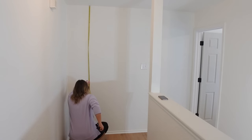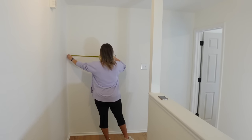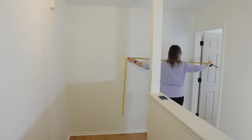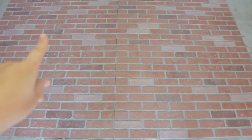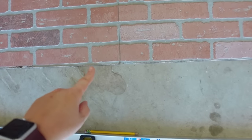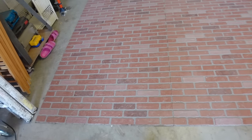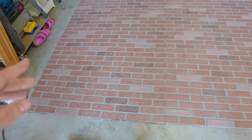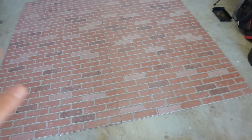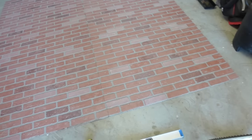The goal is to do it in less than $150, so I'm going to be using brick paneling from Home Depot. You've probably seen this project before in other places, but I'm going to add my spin on it and see if we can get it to look as realistic as possible. The first thing we need to do is take some measurements of our wall. These are two panels side by side — you can see they line up together. Normally I would notch out all of these little pieces so you couldn't see the seam, but together they're a little about eight feet and my wall is a little bit less than eight feet, so if I notched them out it wouldn't be wide enough.